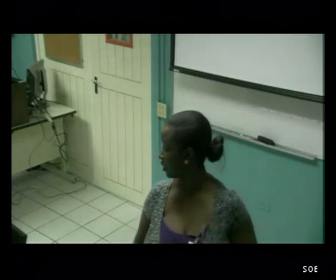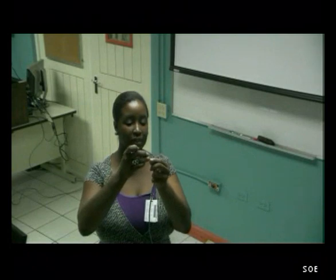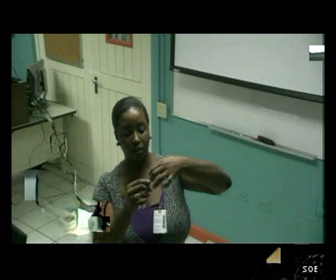Now, we're going to use the 568A, and so we're going to look at the color coordination for that particular standard. 568A, yeah. So you start with? White, blue? White, green? I think it's white, green.